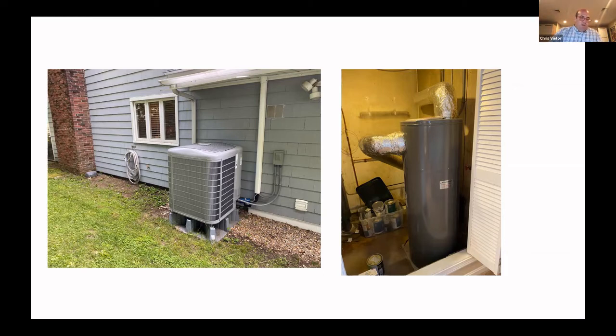The system itself, so again, our home's like 1,850 square feet. To gut the whole infrastructure and install all this new technology, it cost $32,500. But a lot of that was the removal too, and the duct work. So I think Craig said before in his presentation that you can work off of an existing ductwork system. So if you have central heating and cooling in your home, you can use that existing or legacy ductwork for an exterior condenser style whole house heat pump system like this.